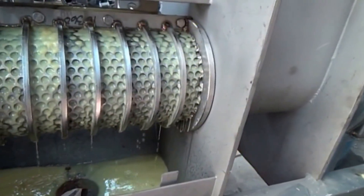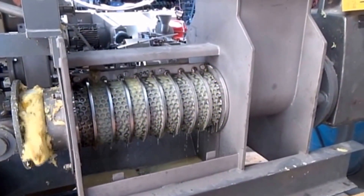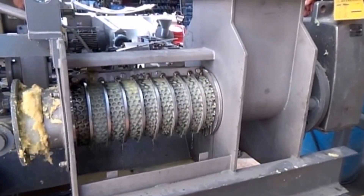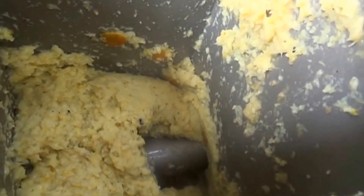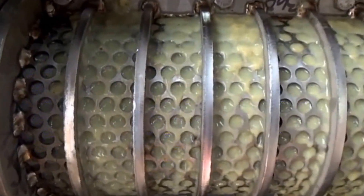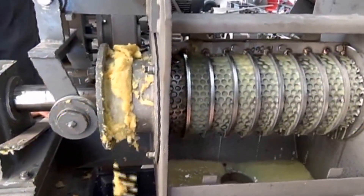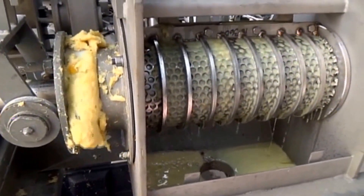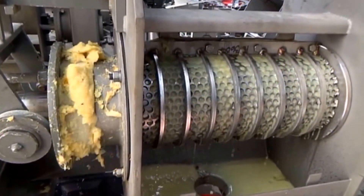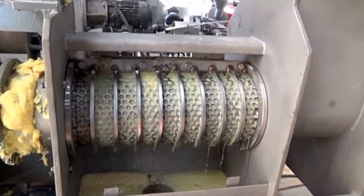That's the last of our sample. This is a standard KP6 press. You really need at least two 5-gallon pails to want a capacity test with it. It's emptying very slowly — very low capacity. Although we do have a steady flow of press liquor and the screen is not blinded over. Probably less pulp coming through the screen than before. I did try the fist test on the sample of the no-shear material and it's as dry as a screw press can get it — I couldn't squeeze a drop of water out of the press cake from the previous test. Low capacity, but maybe it's doing some good.